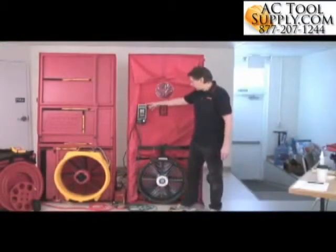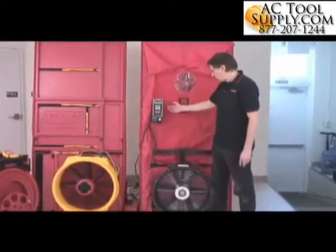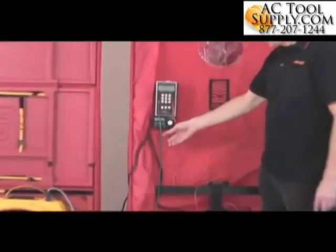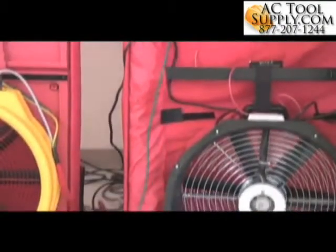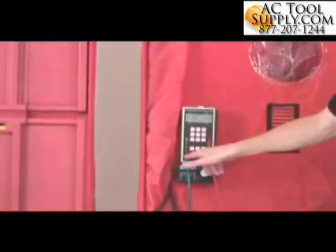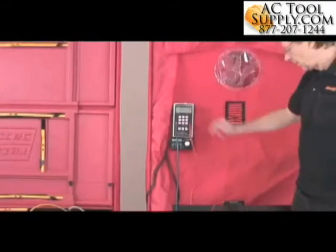So we're going to talk a little bit about the tube coloring, because the color coding can vary. Here on the Energy Conservatory style fan, we've got a green tube that's going to outdoors, and I guess you can think of green going to the green of the outdoors. So this is the outdoor tube, and the red tube goes to the fan to pick up the flow pressure signal or the fan flow. So green to the outdoors, red to the fan.